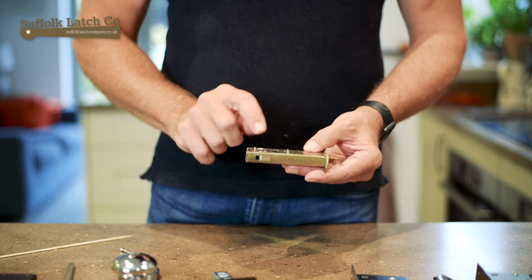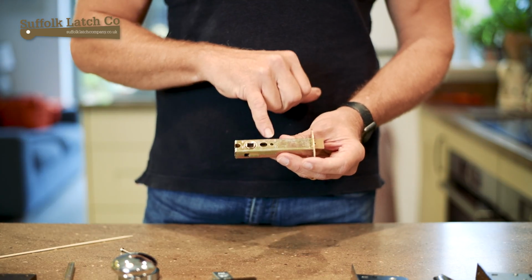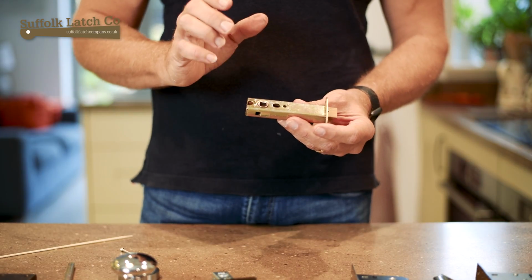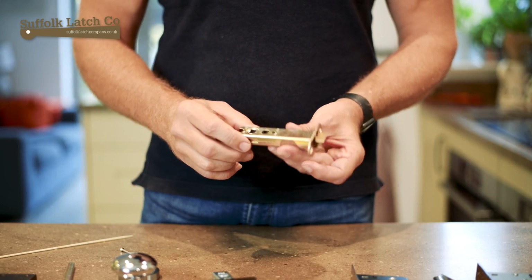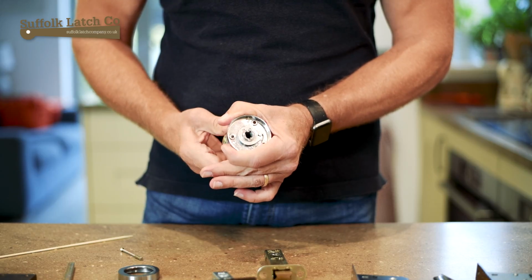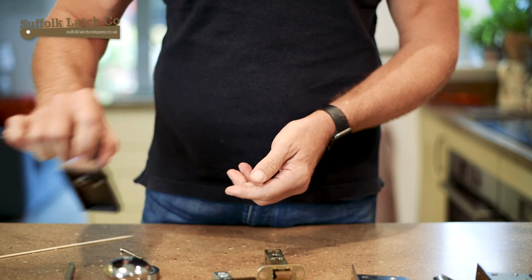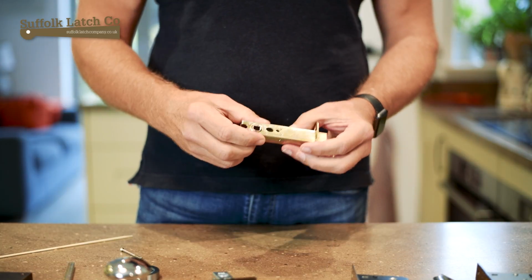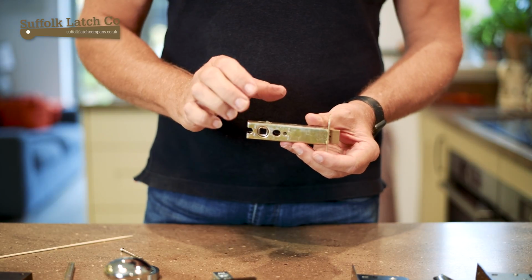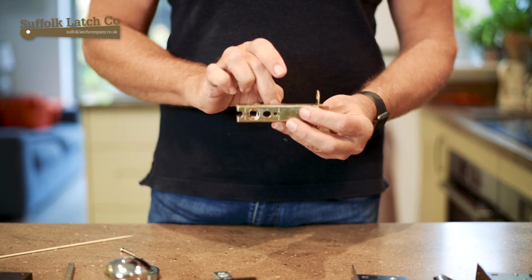This particular latch here, another thing to take away from this, it's got a heavy duty spring inside it, which is something you've got to use for things which are in effect unsprung. This particular doorknob here is sprung. You can see a little spring inside there, but often they're not sprung. And likewise here, this is sprung. But if you've got a doorknob going in which is in effect unsprung, you want to go for a heavy duty tubular latch. Another thing to take into consideration is these things work beautifully as long as they're carefully aligned.